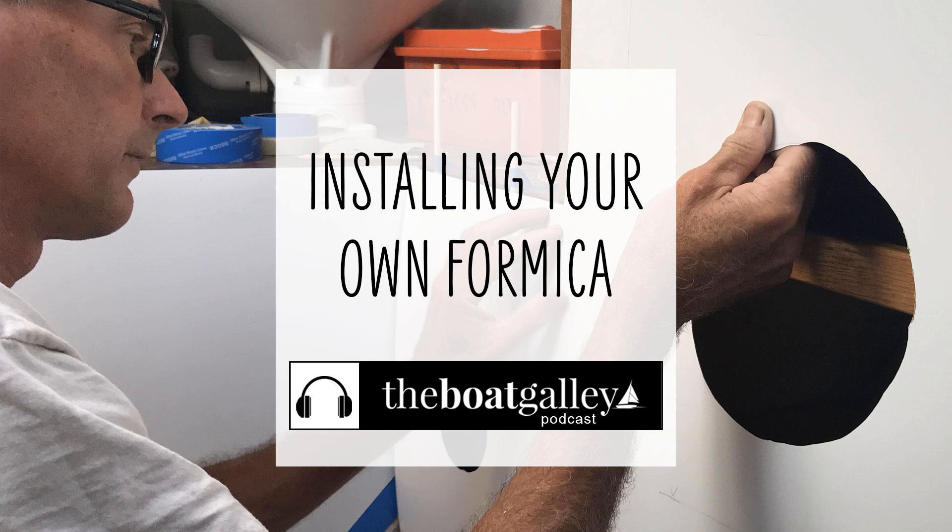But with spaces that are already fixed in place, like bulkheads, you can't take those out to apply the Formica — so what do you do, and what tools do you need? The tools you need are your basic jigsaw, router, sandpaper, contact cement, and maybe a paintbrush — a cheap chip brush is great. The very key pieces you might not think are important: you need a laminate roller and you need dowels. You'll understand why in just a minute. And don't forget the respirator and gloves.